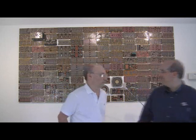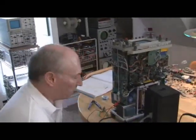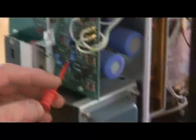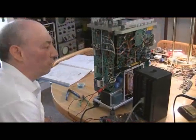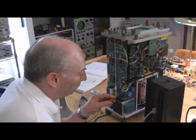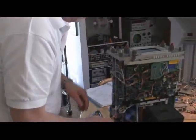We're going to go upstairs to Jim's lab. It appears we have found a shorted tantalum capacitor on the plus 15 volt rail on the trigger board. We didn't do it the way the manual probably tells us — which is to disconnect the connectors from the boards one at a time until the power supply is unloaded. We just went around and looked for tantalums. Dipped tantalum capacitors are notorious fail points in test equipment, and this one is reading zero ohms. So the next step is to turn the scope on.